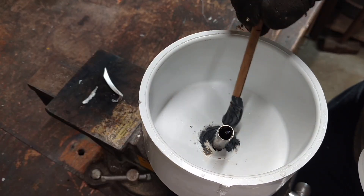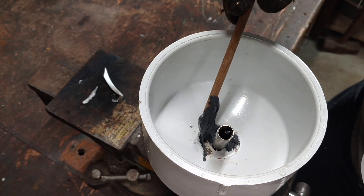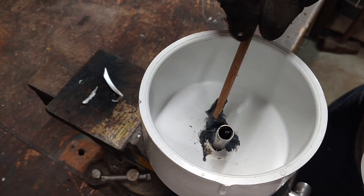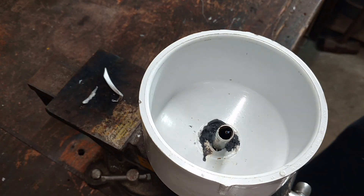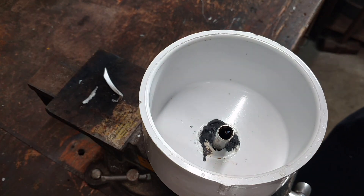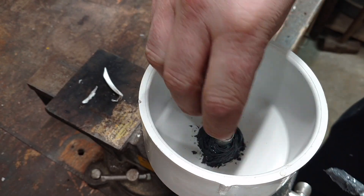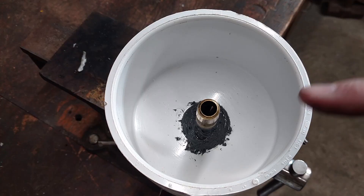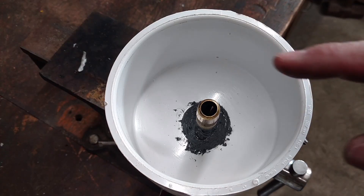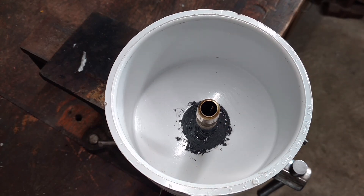There are a few different options for these two-part epoxies. Some of them only work on plastic, some of them are more designed for metal, and you want to try to get one that is equally good at both, because for something like this you're bonding PVC plastic and the metal of the torch. I used quite a bit here, because I want this to hold up to what's essentially multiple explosions in a row. Now screw the tip onto this torch. So once this end cap is mounted onto the combustion chamber, the tip of the torch will be inside, and that will be providing both the fuel and the ignition source.